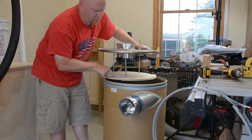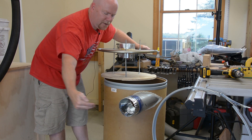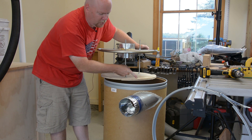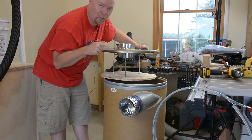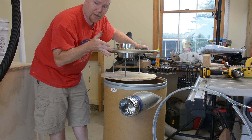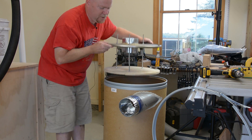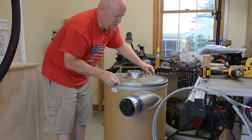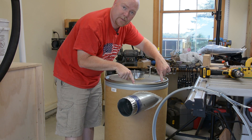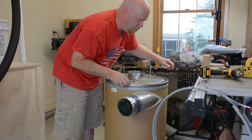When you go to put the lid back on this barrel, alignment is key. The high-velocity air that's loaded with dust is supposed to come in and follow the lip on this baffle before it gets to the crack slot where the chips and dust drop out. The best thing to do is make yourself some marks that line up with the pipe.